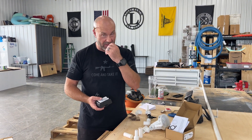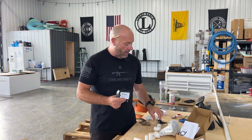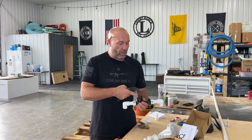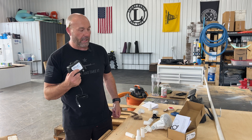And that's what I'm going to do. I'm actually going to convert this to ozone, and I'm going to put an ozone generator on it. You do that through the use of a venturi valve that allows the water to get injected with the ozone. You're going to run this maybe an hour a day, half an hour a day, depending on the load and how many people are getting in it.